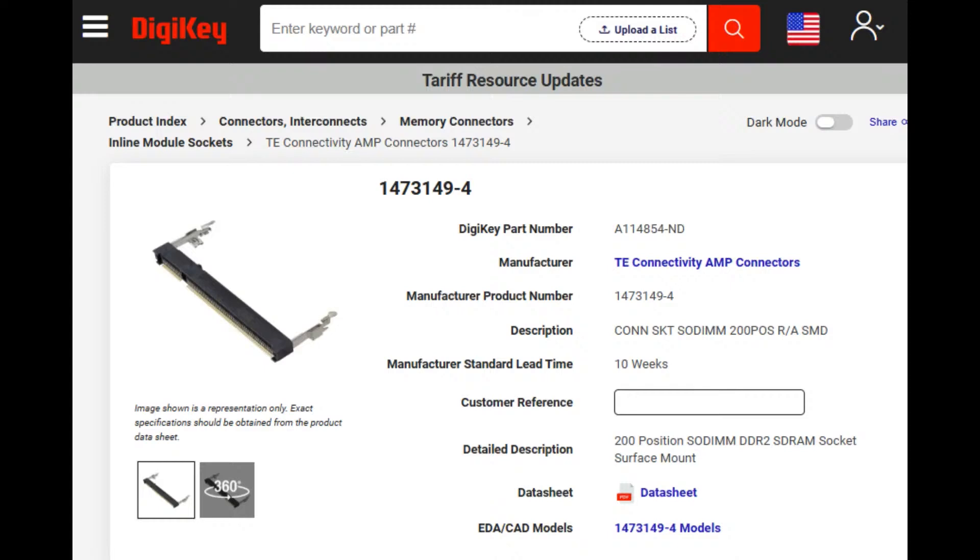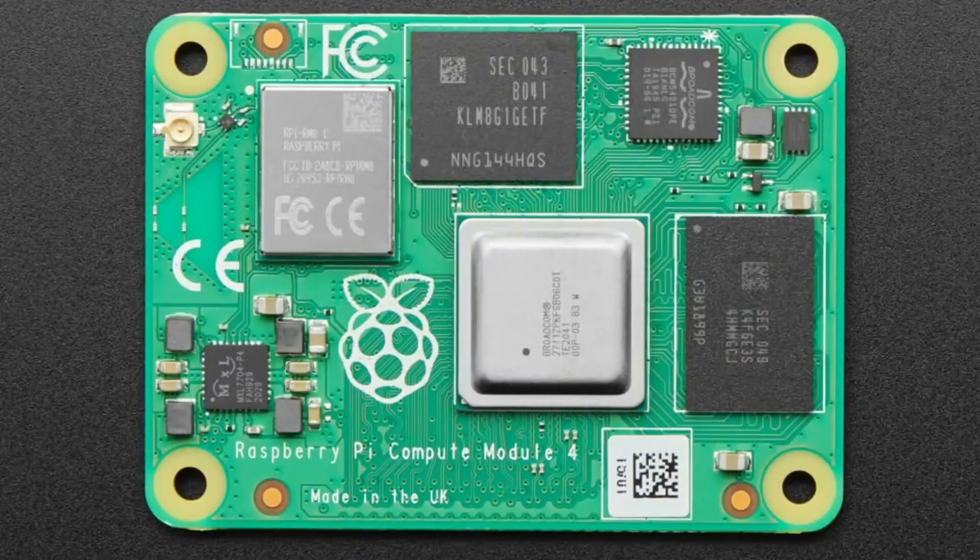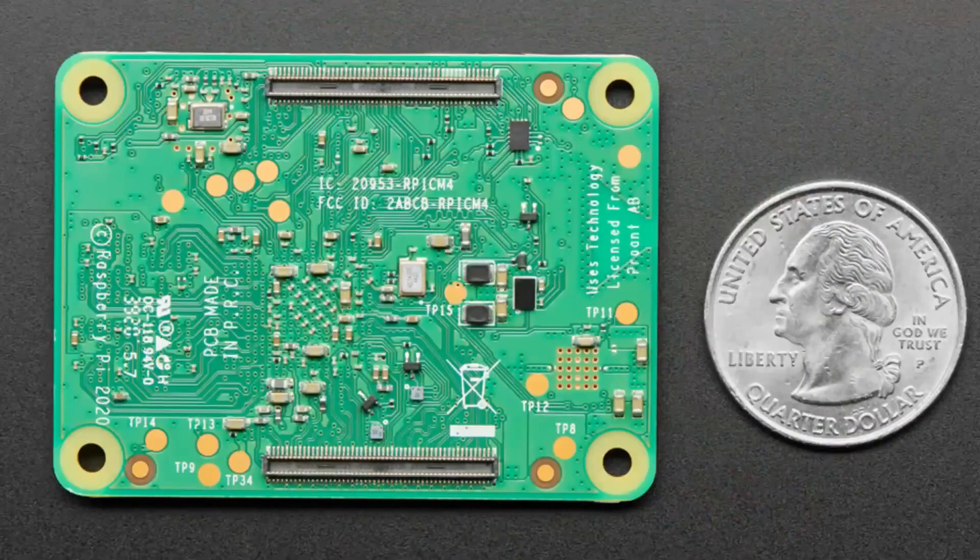They updated once they got to the CM4 to this compact rectangular shape, which was definitely not as thin but narrower, and able to have the components closer together. It probably also helped routing because you can see the EMMC on one side and the RAM, Wi-Fi, and I/O controller all quite close to each other. This version also had four mounting holes — you could really mechanically connect it down. It has a Wi-Fi connector, and instead of having that long row of contacts, you have two Hirose connectors on the bottom, each 100 pins, so you get 200 total pins, up to 80 GPIO.